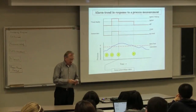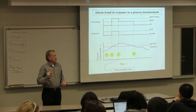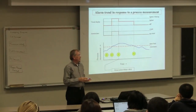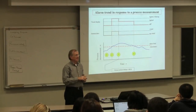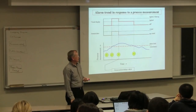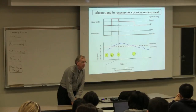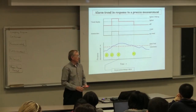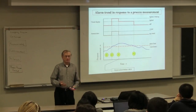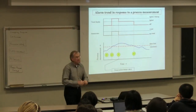What about human nature? If you're an engineer and say, I don't know what's important so I'm going to put alarms everywhere, and they're going to be going off every three seconds—what's the person going to do? That person's going to be constantly pushing the button, and will quickly learn to push it down and jam a toothpick in it so it's always acknowledged. And now when something important happens, the person isn't aware of it and you have an accident. We have to make sure that we only have alarms when they're important—not just because the computer can generate thousands of alarms.